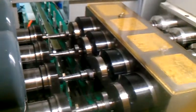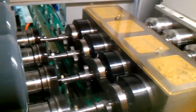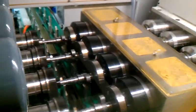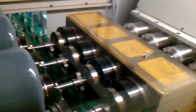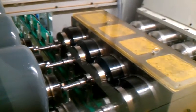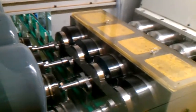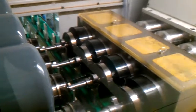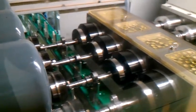Counter-rotation of the parts ensures the most accurate hole possible. The chipbox side of the machine will automatically drop back because the components have the hole started from within the centre bore of the component. This allows the clearance on the loader to ensure that the parts are left intact on the loader for export from the machine.